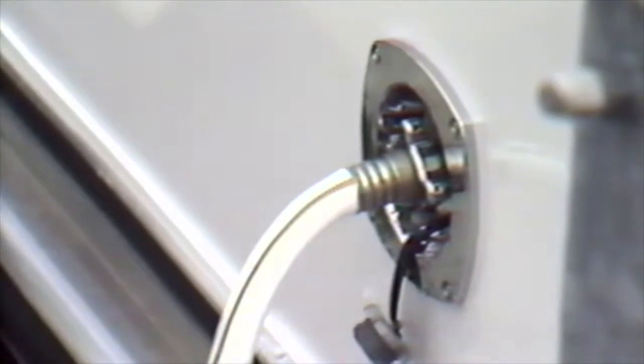Your dock water reserve is supplied to your craft on the starboard side. Prior to departure, turn on the valve and fill your tanks with a fresh water supply. It is best to fill your tanks prior to leaving instead of several days ahead — this gives you good, clean, fresh water for the duration. Your water tanks are standard twin 80-gallon tanks plus a 17-gallon hot water heater, giving you an ample supply for an extended cruise. Most marinas have direct water access lines which you may use as you refuel your craft.